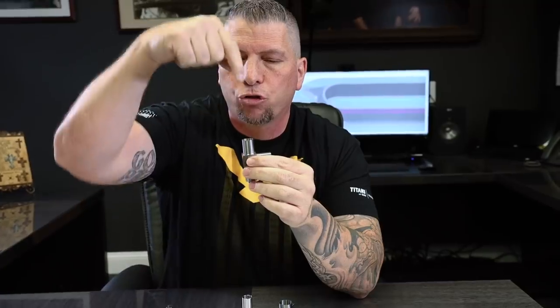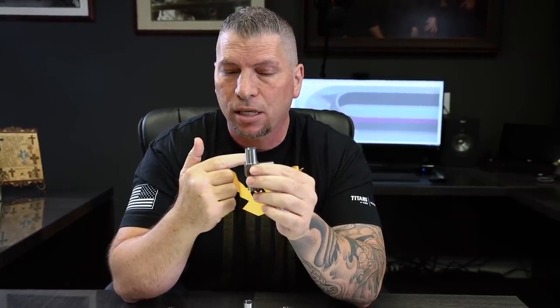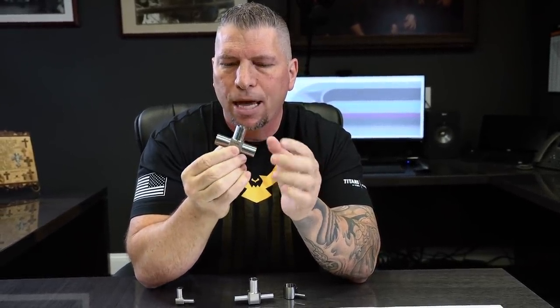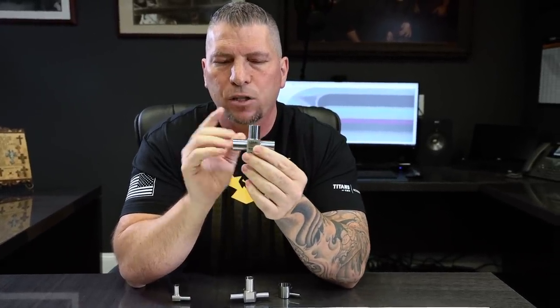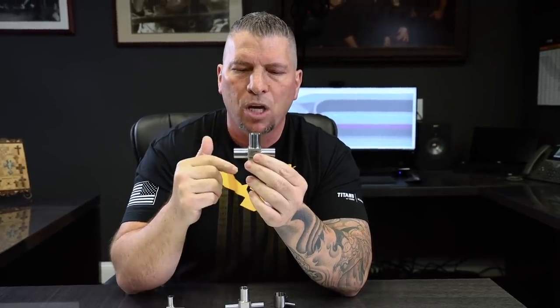A lot of people struggle with T-fittings because they drill and end mill it — end mills have taper and drills walk, especially in hard materials. What my team does is drill and rough it, then come back and bore it using a Kennametal bore head, boring the ID and OD so they're within a tenth and absolutely perfect and repeatable. Then we use gauge pins to the tenth to double-check and put parts on the CMM, inspecting every single tolerance, 100%, with dedicated CMM programs.